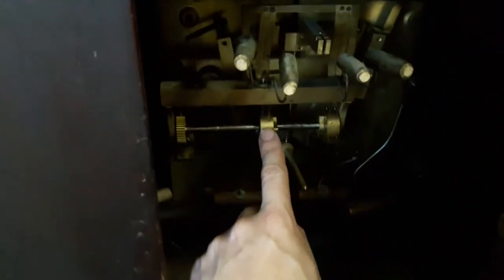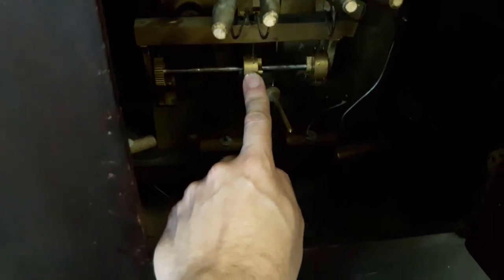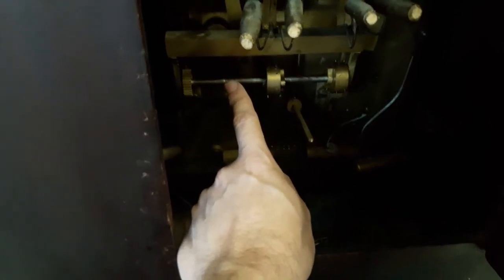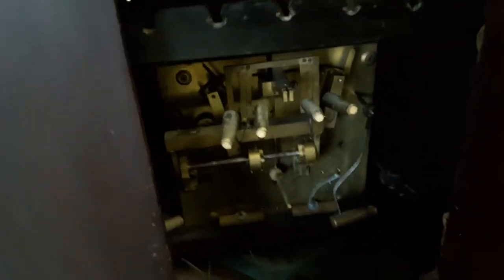You can see here with this pin barrel arrangement they've got, that they would have been able to put another barrel here, or two, to turn it into an 8 or 9 tube striking chiming tubular bell clock by just adding the extra barrels on here without changing too much of the movement. I don't know who makes the movement. It's got 2 fans to adjust the speed of the chime and the strike, which most of these tubular chime clocks have. It's a very big movement. I think I should be able to tip it forward slightly to have a better look. Get the light in there.